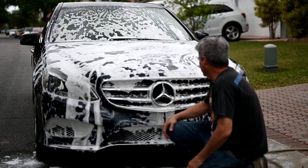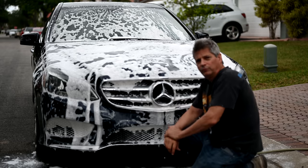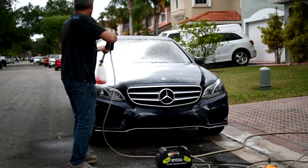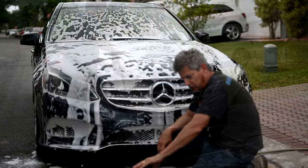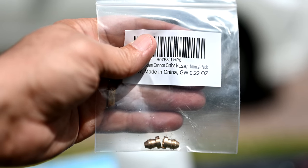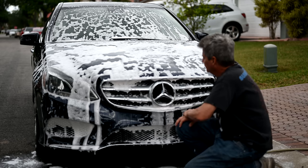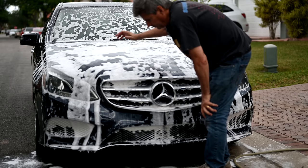It's got a little bit more flow than the Ryobi, but it's a pretty close contest. Looking at about four minutes on the Ryobi side and about two minutes on the DeWalt side — both did really well. In terms of which one is doing better, they both look fairly good, although because of the higher pressure of the Ryobi at 1600 PSI, it puts on a slightly thicker coat when first laying it on. We're still working on tweaks — one we already did was order a 1.1 millimeter orifice; it comes with a 1.2, and going to 1.1 helped shoot more pressure out the nozzle. Both are still holding on at close to five minutes, which is great for loosening dirt.